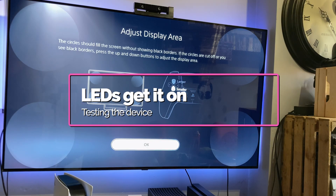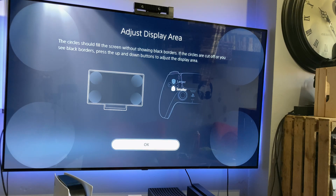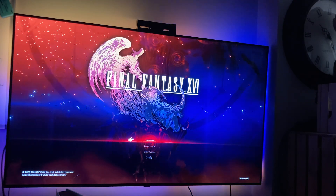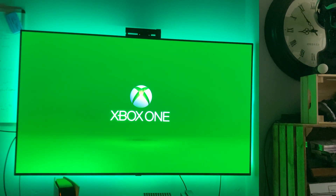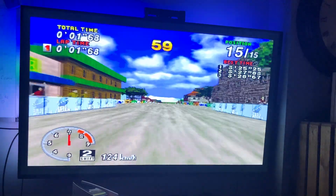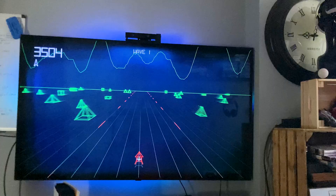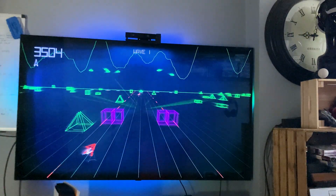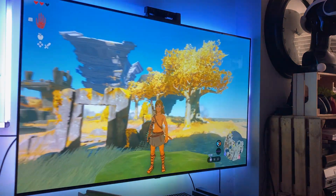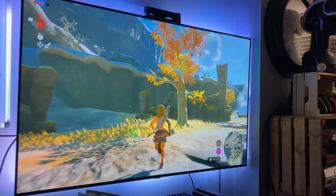Be aware that once you've plugged every device in, you will need to reconfigure them once as they will detect it as a brand new screen. The device itself is fully HDMI 2.1 compliant, fully supporting HDR, 4K 120, and 8K 60fps, so all features on your latest consoles and PC work straight out of the box. It worked with every device tested: Xbox One, PS3, PS5, PC, and even retro consoles — though for retro you need to route them through an HDMI output. It even supports VRR theoretically due to HDMI 2.1, though there were some issues I'll cover towards the end. The device auto-switches between inputs, and you can optionally power it from the TV's USB for pass-through without LEDs.